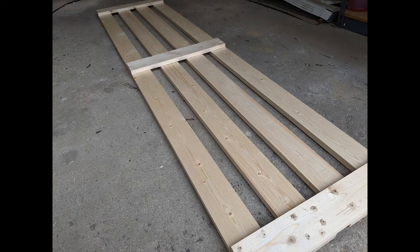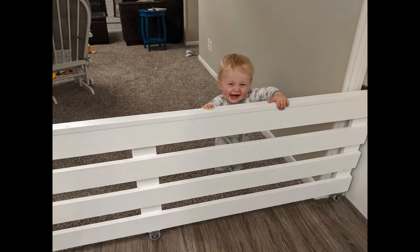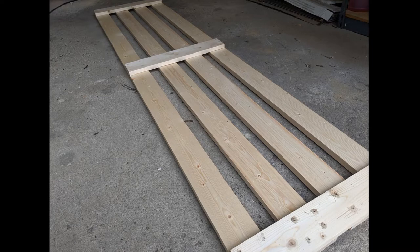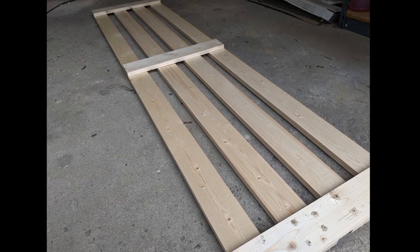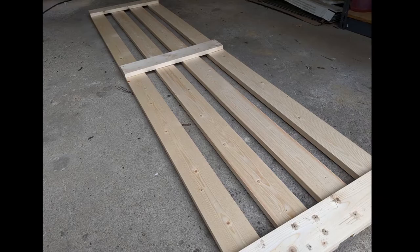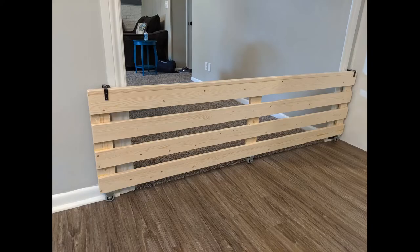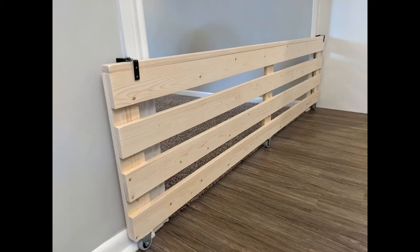The gate I built is made out of simple 1x4s. The length of the gate goes a couple inches beyond the trim of the opening. My gate was built by laying out four 1x4s with equal spacing between each. I then used wood glue and brad nails to attach three vertical pieces of wood to connect everything together. Two of the vertical pieces are placed on the ends and the third is directly in the middle. I designed my baby gate to be about 23 inches high so that we could easily step over it when it was in place, but this design could easily be made taller if stepping over it is not important to you.